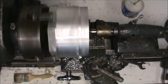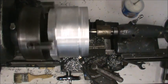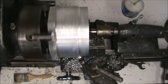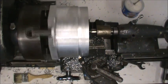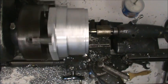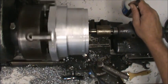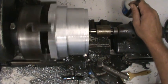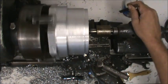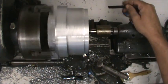I ground up a piece of quarter-inch high-speed steel for my tool with a nice little chip breaker. I really got it cut sweet — a beautiful chip. The spindle speed is 45 RPM, the feed rate is 7.5 thousandths per revolution, and I'm taking 100 thousandths depth of cut, so that's 200 thousandths off the diameter each pass. That's a big cut for this machine.